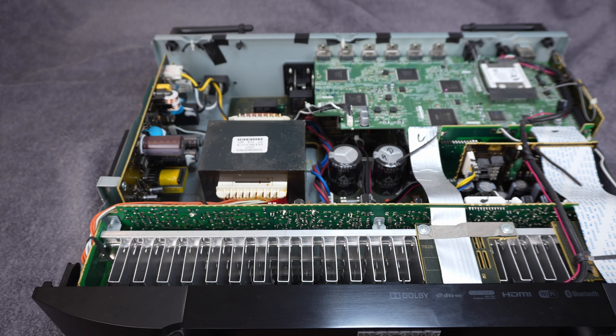I've got a Max device over here. An Altera - yeah, it's an Altera device. So an FPGA over there. This up here will be some sort of a power supply. I've got these little surface mount inductors. And this here will be the wireless module, I would suggest. So that's your antennas connecting to this wireless module underneath that bit of black tape. And you've got your ethernet there. So I think that's probably about all there is to see really in this device.